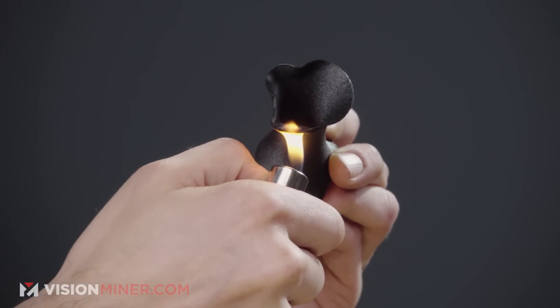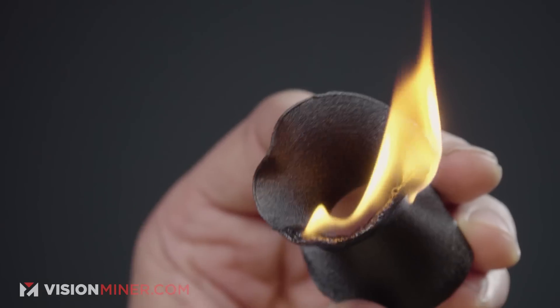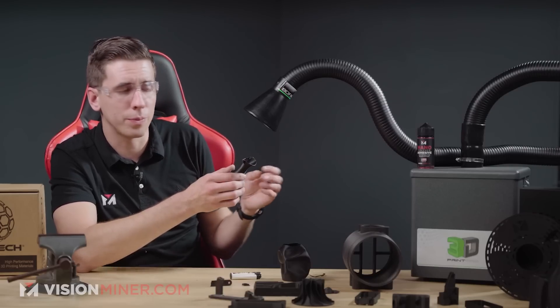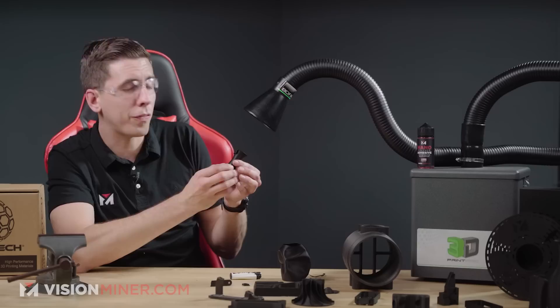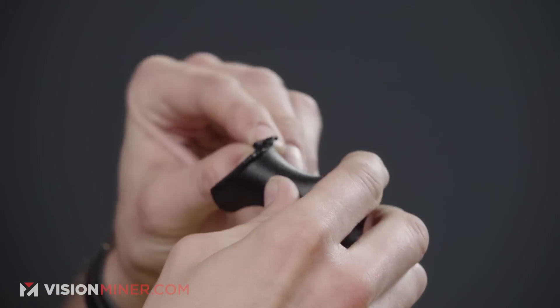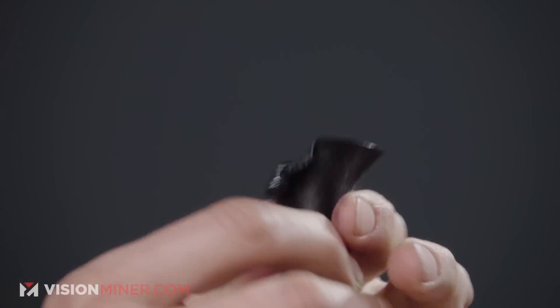Three, four, five, six, seven, eight, nine, ten. It's on fire. It's going to drip. So it's definitely not flame retardant — it keeps going unless you act quickly. I'm blowing it out and letting the fumes go into the extractor. The parts that burned are now shiny. If you want a shiny surface, you can actually use a heat gun over the surface to make it shiny again. It is also machinable at certain levels. The material is still soft 10 to 15 seconds later, but as it cools down it will go back to the stiff, rigid hardness it had before.